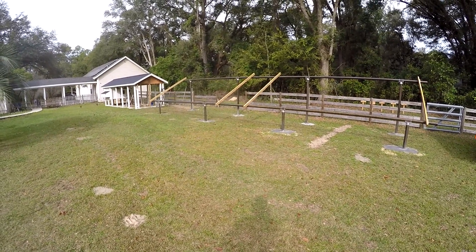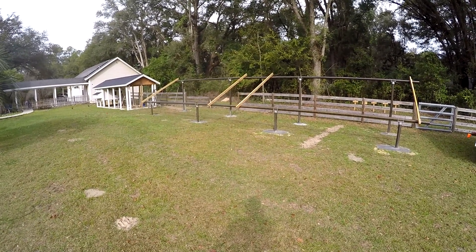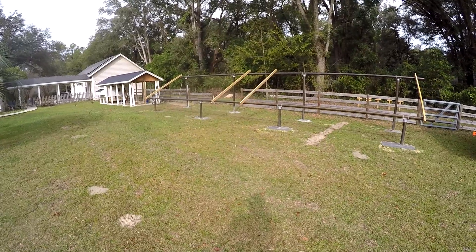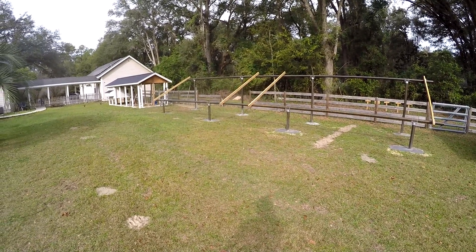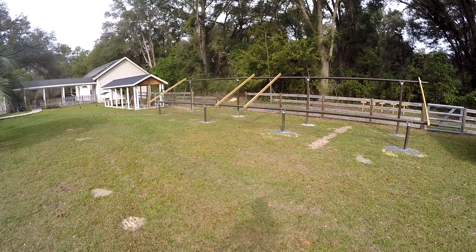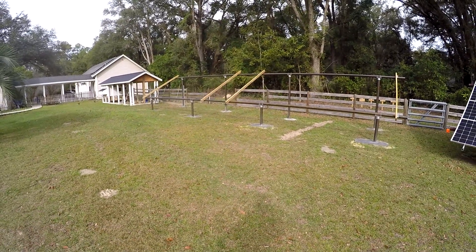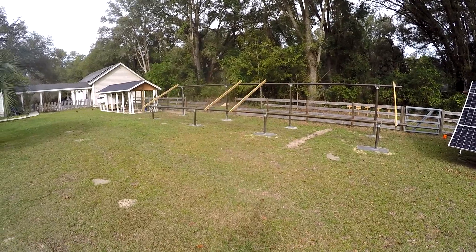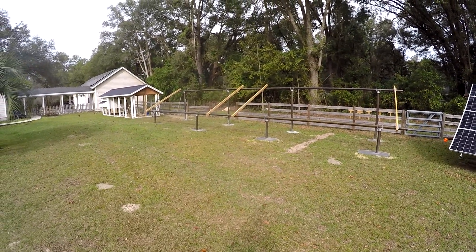Now if you're in the Midwest and you don't see hurricanes and you only have 60 mile an hour winds — that's velocity squared, so you can reduce it quite a bit, I think it's four times — so for this size array with 60 mile an hour winds, you might get away with 4,000 pounds. I haven't done the math on that, but I just thought I'd mention that because I see a lot of arrays that are seriously underbuilt, and that's fine until the wind blows.